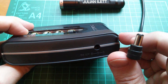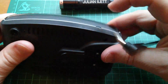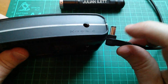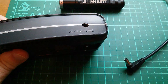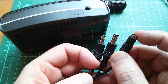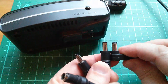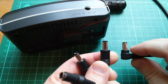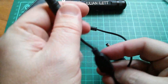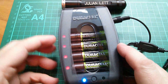So here's 12 volts — it's actually 13 volts today. The odd thing about this socket is it's very deeply recessed, so the plug doesn't stay in very well and you've got to find a long reach plug. I found this two-way splitter, female to double male. The plug length is just a fraction longer than the one that wouldn't stay in, so this should be fine — that'll stay in there. Let's plug my solar 12 volts into the unit and the batteries start charging.